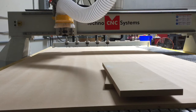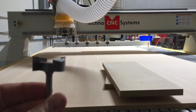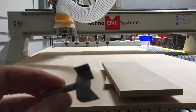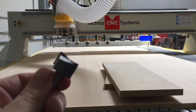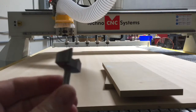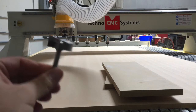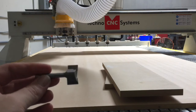One thing I've never really been a huge fan of is the large diameter table milling or spoil board surfacing tools. In the past I've always used something fairly small — a one and a quarter inch. You can find them from all the major tooling manufacturers; they all sell a variety of sizes. Here's a one and a quarter inch as an example — they use carbide-tipped throwaway blades, so once it gets dull you just toss it. They run about 40 to 45 bucks, so overall cost is fairly low.